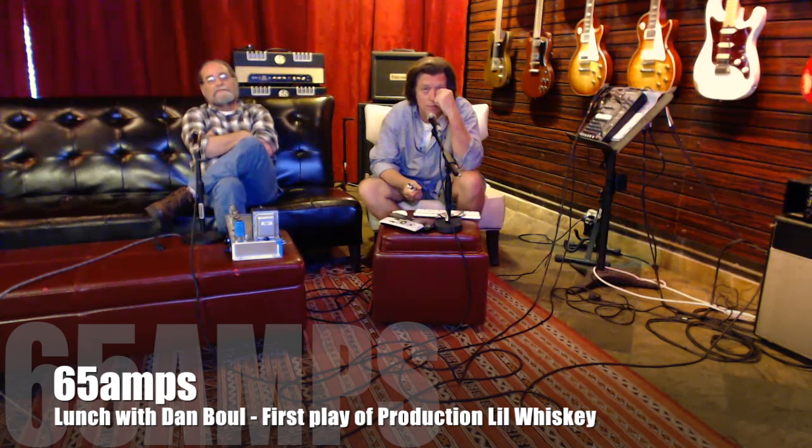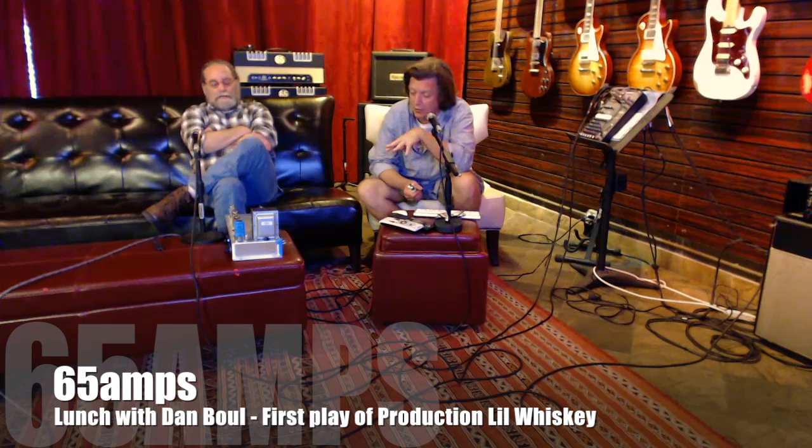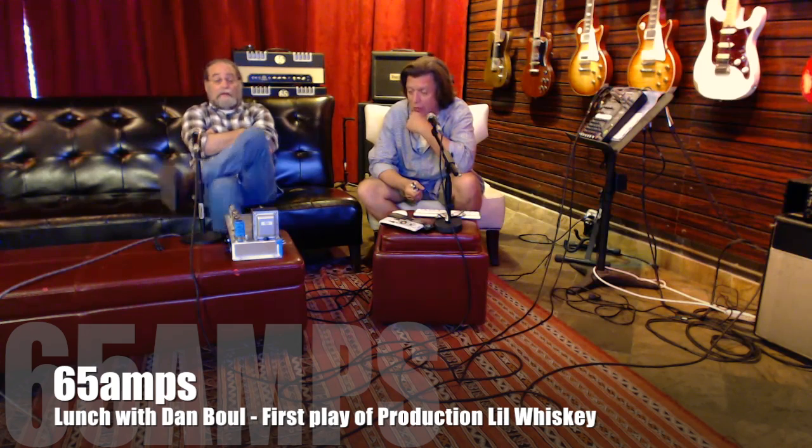Yeah. So one of the things you and I were talking about, Miles, were the choice of preamp tubes in here. And it was a funny story because I've always been a big proponent of long plate tubes in the preamp for my normal 65s because they're low gain and all these sorts of things. But finding out those are not the best for a gained up circuit. And also the quality of those is going down. Our reject rate is increasing rapidly on those, to the point where I'm almost thinking I might have to quit doing it on the regular amps.